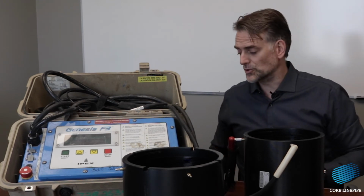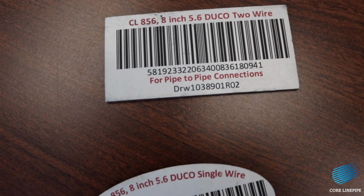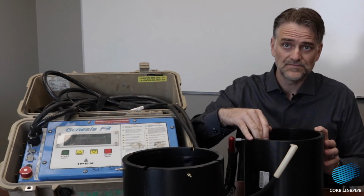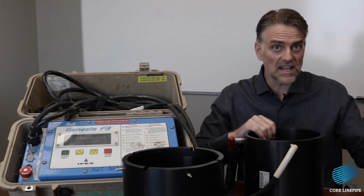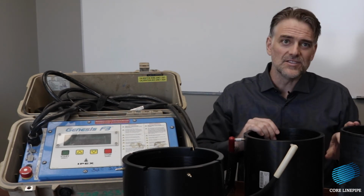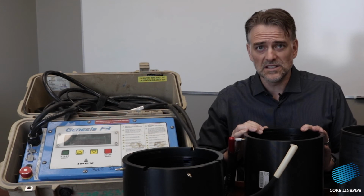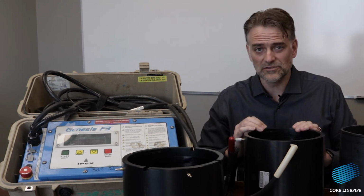This is closely controlled by the welding unit by scanning barcodes that are specific to the type of fitting and size of pipe. When voltage is applied to the fitting, the coil heats up and heats the fusion zone. The plastic of the fusion zone expands as it warms, eventually coming into contact with the scraped liner, transferring heat to the liner as well. As the 2 parts heat up, they continue to expand, creating pressure within the fusion zone. The plastic then melts and becomes one continuous piece of plastic as it is held for a period of time at the temperature and pressure required to fully bond.